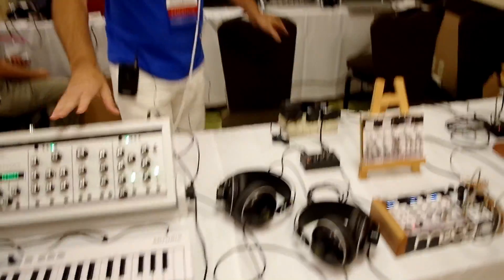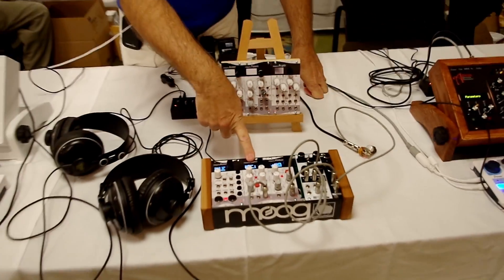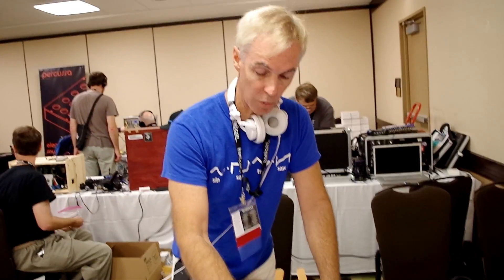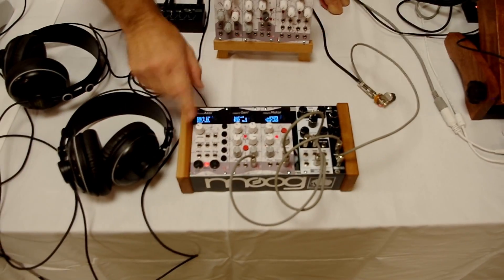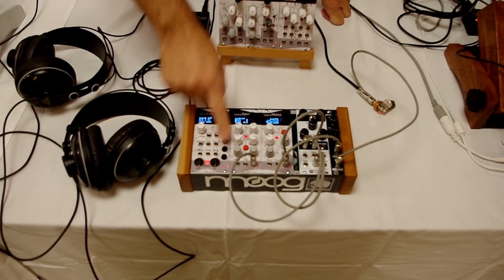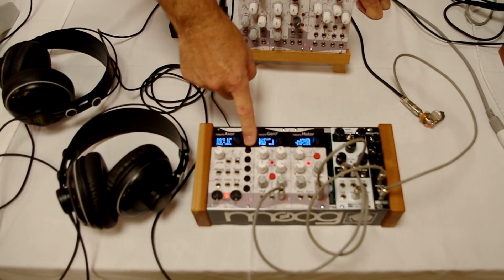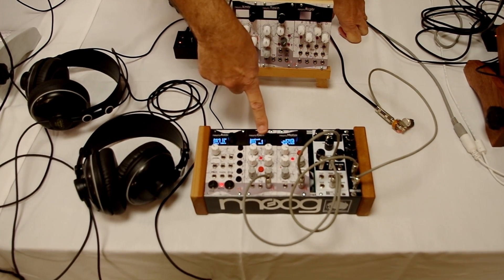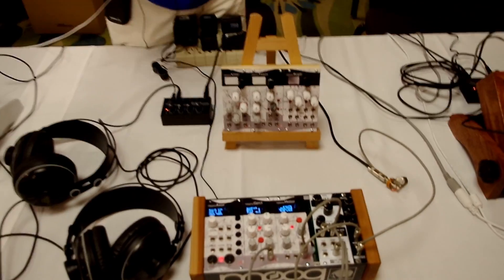The next thing I did is take that idea of patchability and system patchability and move it over into a Eurorack system. Each module will record up to 250 of its own patches — all the knobs, all the inputs, the modulations, all of that is going to be recorded. On the main control module — the MIDI interface — there's a series of five radio buttons. If you press one, it'll say 'patch change one,' and what that does is it remembers that patch change one sends this module to patch 25, another to patch 10, the oscillator to patch 15, VCA to patch 5, and so on. It sends a command over the same high-speed bus to recall the patch.